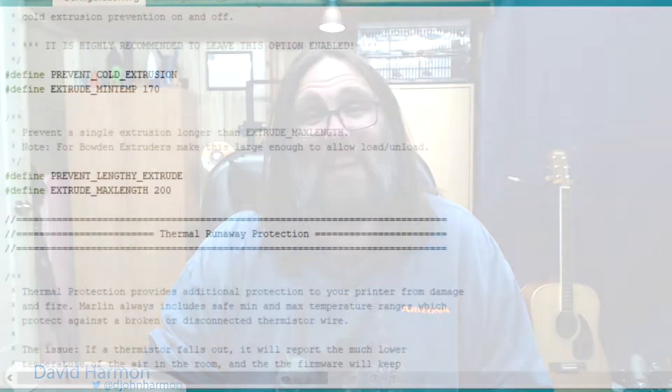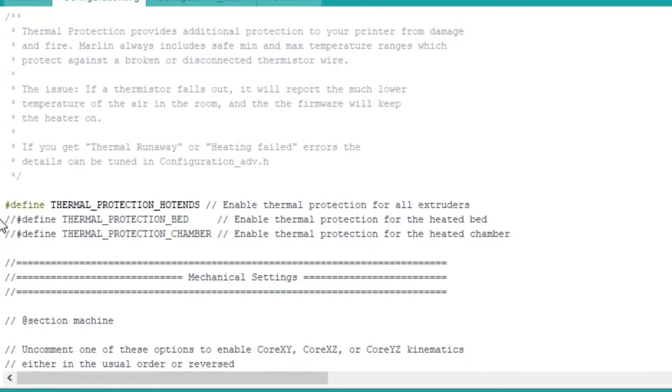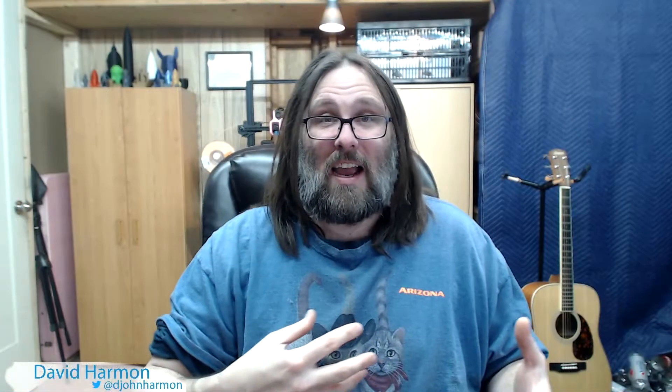Think of 3D printer firmware as more like the engine of your car — you wouldn't demand a retailer change your engine every time a new car came out. So why would we consider changing our printer firmware? The simple answer is something's changed: we're missing a feature, we want to add a feature, maybe we changed our controller, or maybe we have an older printer that lacks thermal runaway protection — that's a simple thing to add in Marlin. Sometimes a firmware upgrade really just adds bug fixes, and if you're not experiencing those issues, you really don't have to upgrade.